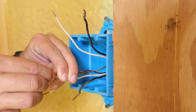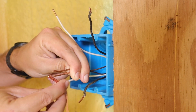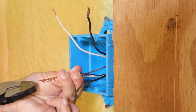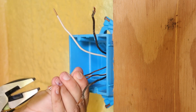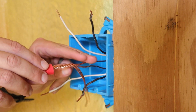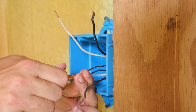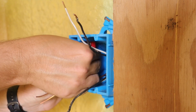I'm going to take both of my ground wires coming out of the box and put those together. Then I'll take my two ground wire pigtails and combine those with the two ground wires from the box. Once they're fairly well lined up, I'm going to take my linesman pliers and twist them all together, really twisting them down to where they create a nice bond. Then I'll take my wire nut and tighten it down on top of those wires until I really can't twist anymore. Now that the grounds are done, I can tuck those into the back of the box.